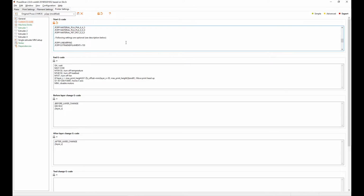If you don't use linear pings, the distance will increase further and further, and if you have a printer that has some variation in the amount of slippage you have in the extruder, for example, so the actual usage varies a little bit, you can get problems if the distance between pings becomes too big. So I would recommend just keeping it at linear ping. In addition to turning on and off linear ping, you can also set the linear ping length.